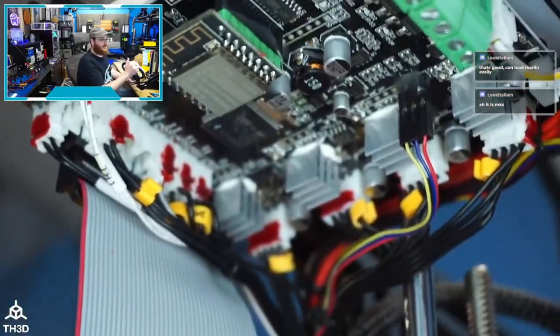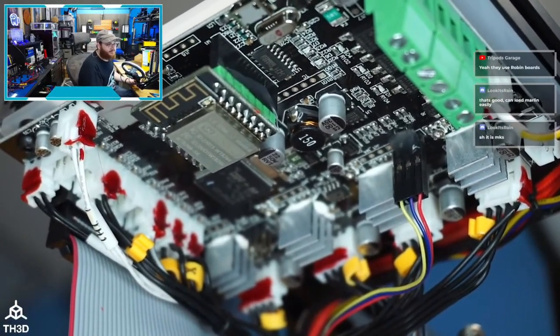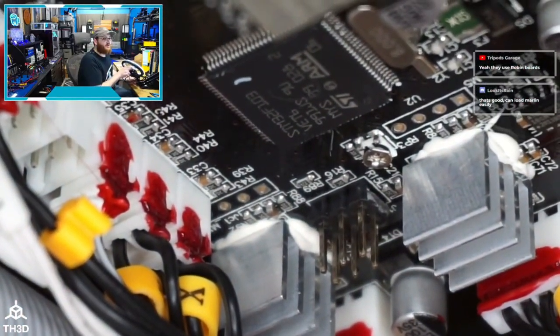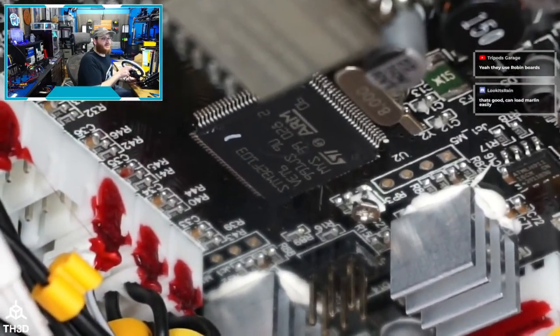The tinned wires and the wire gauge difference are absolutely stupid. But the board itself — the processor is an STM32F103VET6, which is a genuine STM processor. Your mileage may vary with silicon shortages, but as far as I know MKS has not been swapping out for knockoffs. We've got heat sinks on the drivers — probably because of low copper count on the PCB. The board looks like the MKS Robin, but instead of a thin flat flex ribbon cable for the LCD, they use a more robust connector style, which I prefer.